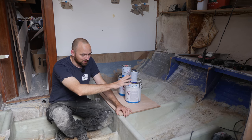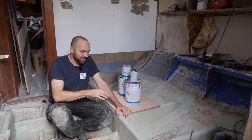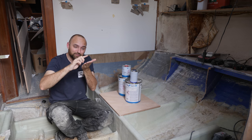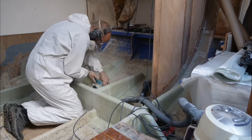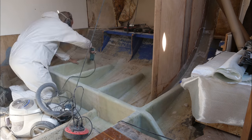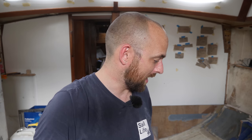Although I've already spent a couple of hours sanding and prepping all of this for paint, I have more work to do — and that's my own fault, because I wasn't careful enough when I put down the peel ply. I got little pockets of air trapped between the peel ply and the new laminate. Now that doesn't hurt the strength of the laminate, but it forms a little indentation which doesn't look good. I'm going to call that good enough — once the cabin sole goes on there, you're never really going to see that area again, so yeah, I think that's good enough.